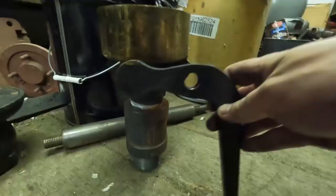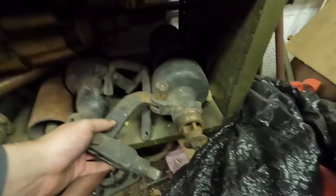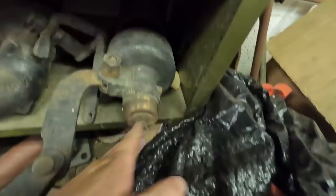If I take the whistle and flip it up, you can hear a clink, and that's the vertical valve. There's actually a slot there, and when you put this lever in the slot and pin it in, and then you pull the whistle lever, it presses down on that vertical valve and it allows steam to flow around it. Here's one that's actually in place. You can see as you pull the lever, this would be the rest of your linkage, the plunger comes down and then it allows steam to flow around it, and when it closes, it seats right there, and steam pressure actually holds that shut the whole time. There's also a set screw back here to make sure that the valve can't fall out and fall into the boiler.